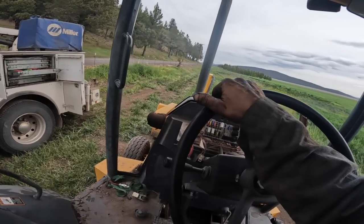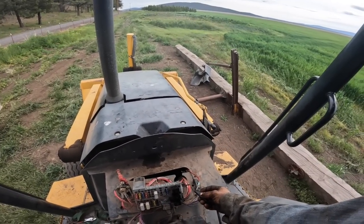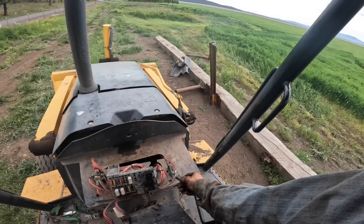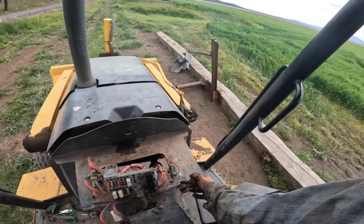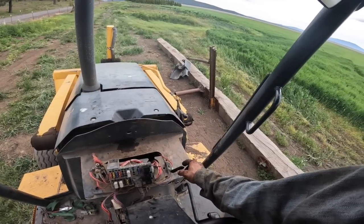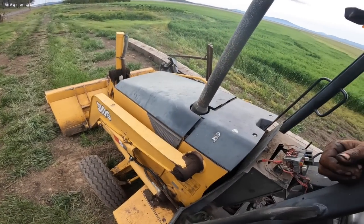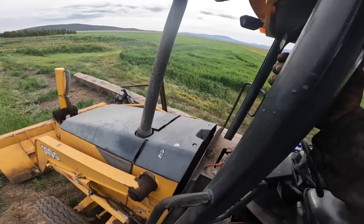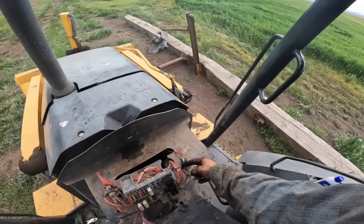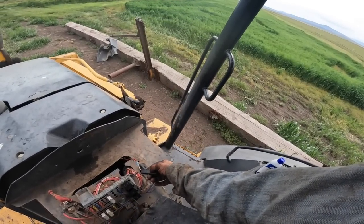Well, guys, there you are. So there's more to the story on this. If you get this diode fail and it's shorted, it means you're getting continuity both directions. If the diode was open, you'd have an open in both directions. The way the diode's going to work, you're going to have continuity in one direction. And the whole purpose of this diode, the way these knuckleheads have got this thing working: when you go to the start position, this wire is spliced into the S-terminal, the signal side going to the solenoid on the starter. The whole purpose of the diode is not to send power through the ground side of this when this is in the start position. That's what that's for. It prevents current flow from going that direction.